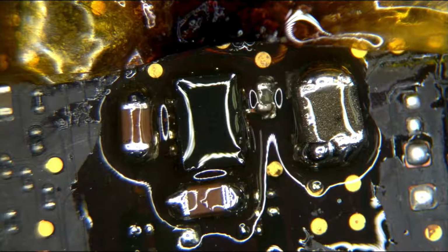See, when the solder has flux on it, surface tension moves everything into place if you just heat it up. It's a nice thing to rely on if you're a klutz with your hands like I am. Nice try, resistor. You're not escaping. Well, you see, you tried to make a run for it. Little mofo. Nice try.